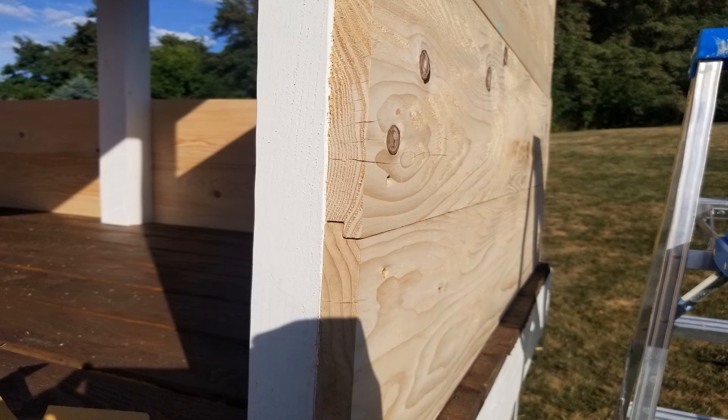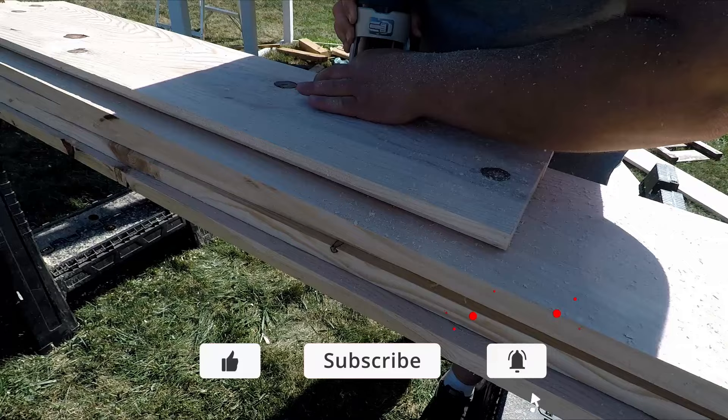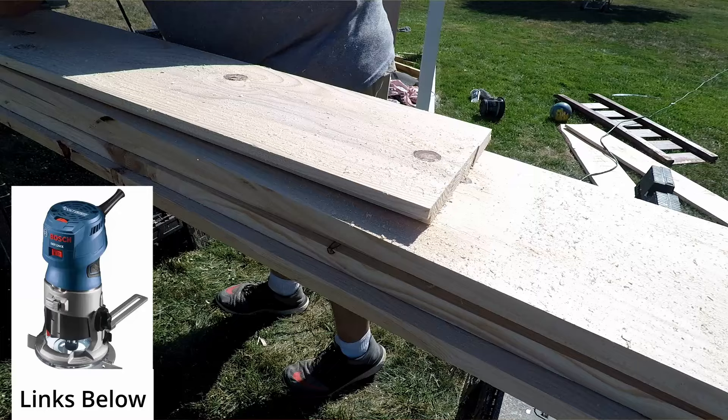The overlapping wood allows for the wood to expand and contract while still keeping the building sealed. Here's an example of true shiplap that I made for my kids' playhouse. You start with boards — these are generally wide boards, about eight inches wide. The way I'm going to make that lap joint is by using this router to cut each side of the board.